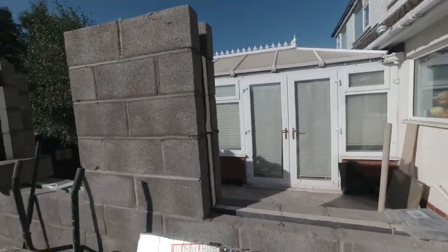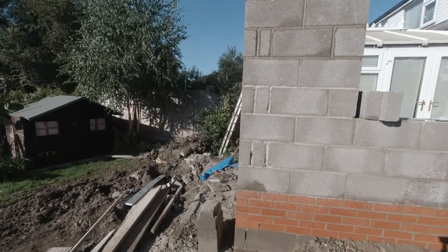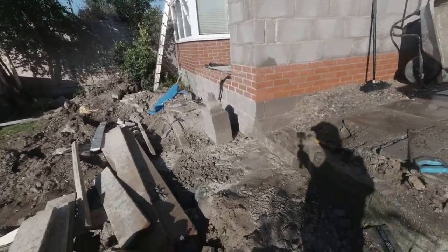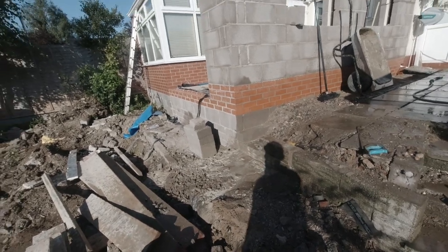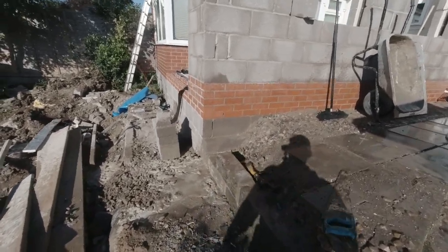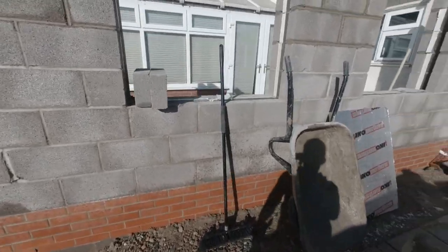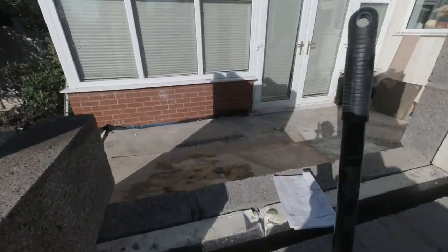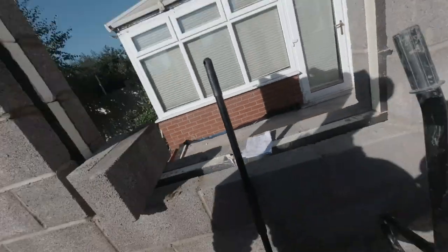So there we go, ladies and gents. Not a bad week's work there. All the footing, block up the footing, up to splash, and then run round inside and out, blocks inside and out, and also pour the concrete floor, bosh, insulated, up sand, everything. Pretty good old job.